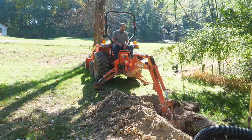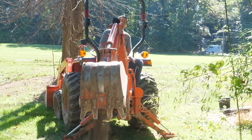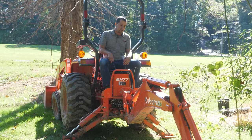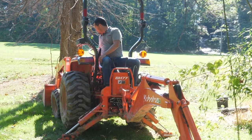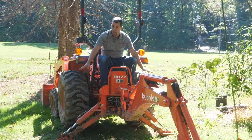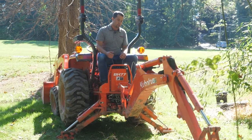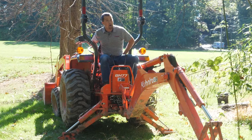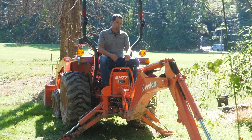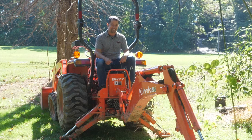You could definitely be a lot more productive this way and get right back to digging faster without having to get on and off the machine all the time — it's a technique you'll see a lot of more experienced operators using. But remember, you want to be mindful of planting the machine back down again, putting the thing back in range, and keeping the outriggers down close to the ground so if this thing goes a little sideways or decides to roll, you can catch the machine. When you're in the back, there's no seat belt and the controls aren't as easy to grasp, so definitely work in a flat area the first couple of times and practice before you get in a sticky situation.